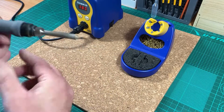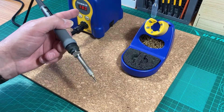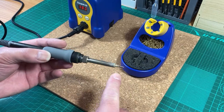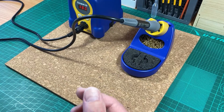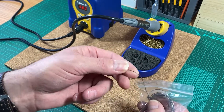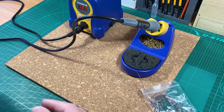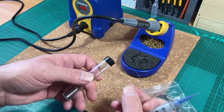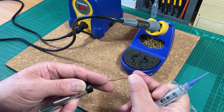What I try to do is prepare all my parts so I can do one big session at the high temperature, because remember the higher the temperature the quicker the tip is going to oxidize. This high temperature — 380 — is the recommended temperature for the DCC 179 solder that I use mainly, but also it's a good temperature for solder paste and the generic solder I use later.